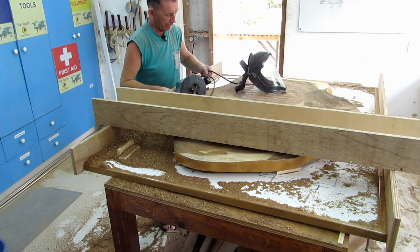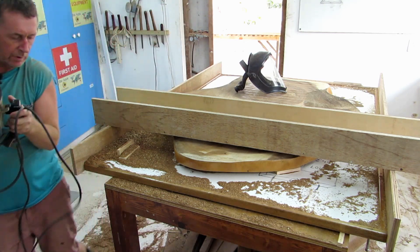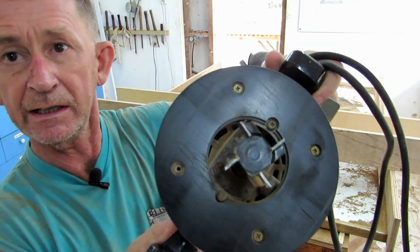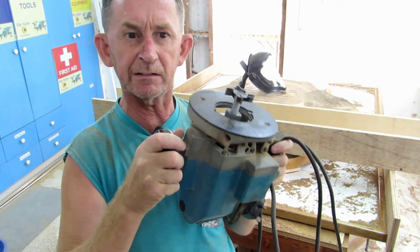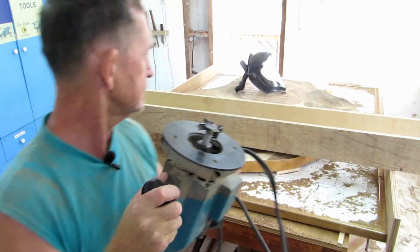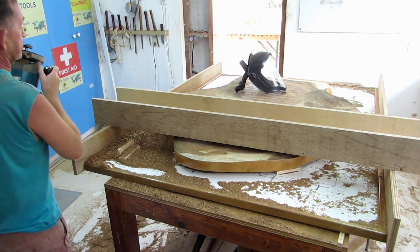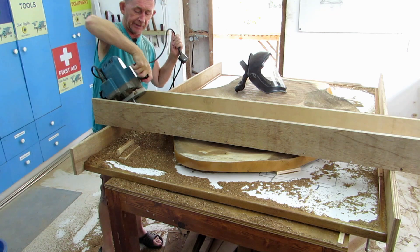The bit I'm using is 50 millimeters - I'll give you a link to where to get it. I'm doing one millimeter at a time. You need a heavy duty router. This router is nearly 30 years old and it's still being sold - Makita still sells it, though I think all the new ones are variable speed. This one doesn't have variable speed.